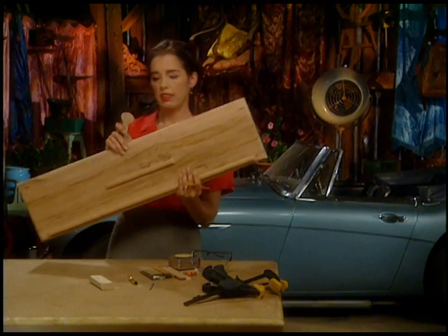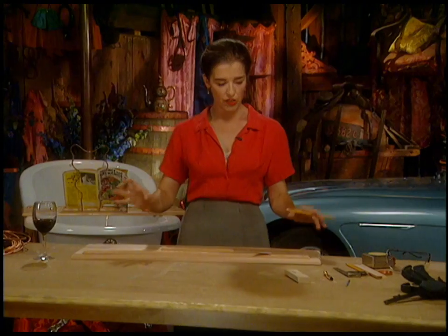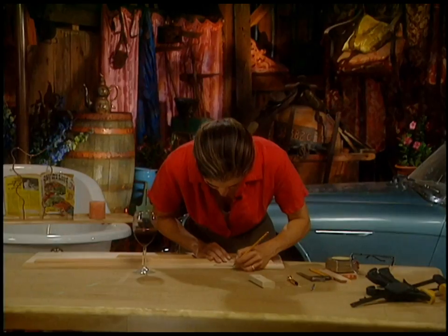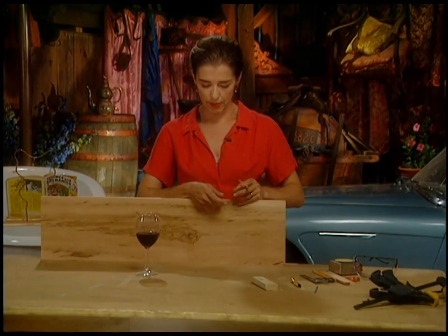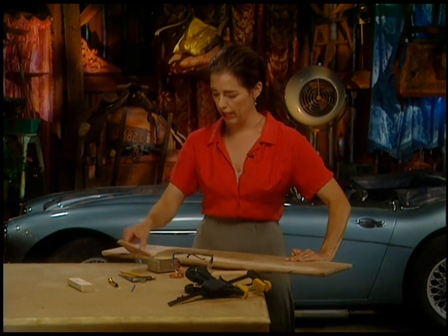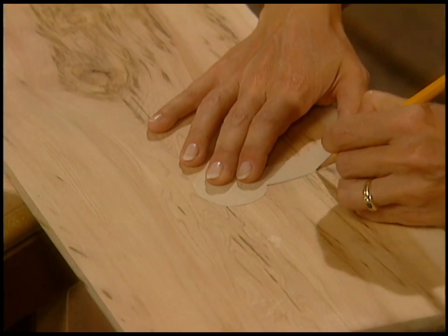Here's another thought — remember the edge of this bathtub has sort of 3-inch sides, so really I have to account for that. My wine glass, I've got to set that in a bit, and then I'm just going to make marks because I've got to flip this baby so that I can work from the other side. I'll make these marks here and here, then flip it over and trace my little design. I can insert my blade right in that little hole and then I'm off to the races making that arc.